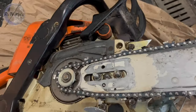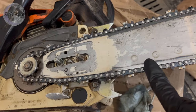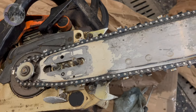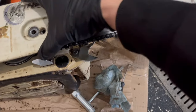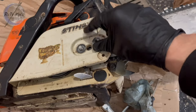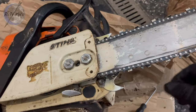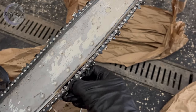All cleaned up for the most part — probably clean it up a little bit more. Get all the wood pulp out of here, then put a sharpened chain back on this blade. I like to flip the bar over every time I put a new chain on — it just helps the mechanisms inside wear more evenly. I'll hold that cover here, back on the studs. Start by just giving it a snug down — not super tight, just barely snug. Snug the front one down finger tight, and then just make sure this chain snaps a little bit.